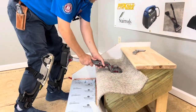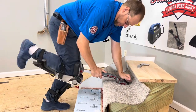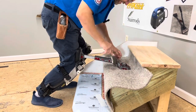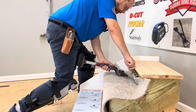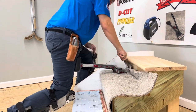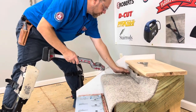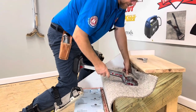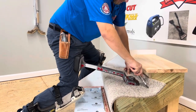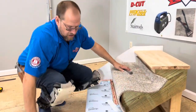Starting in the center of my step, I give it a good push because this is stretching the carpet onto the step. I'm going to use my stair tool to collapse it onto the tack strip. The very next push I do is at an angle to the left, to the wall. It doesn't really matter which way you work first — I just always work to the left. We now have all that secured.